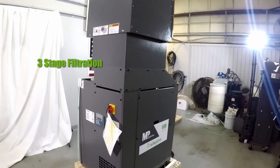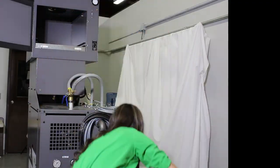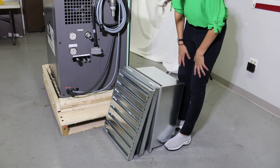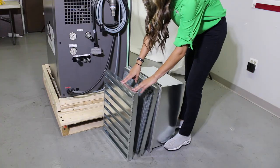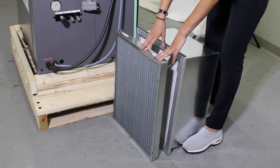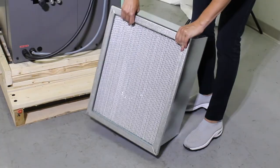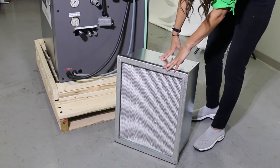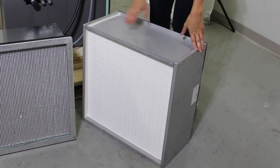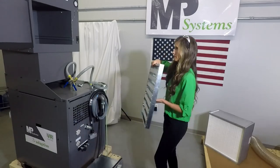This is a three-stage media filtration unit. I'm going to open this up so you can see inside and show you how easy it is to take out all three stages of the mist collector. This is the baffle filter — it is reusable; you can hand wash this one. This is the wire mesh filter, the second stage of filtration, and this one is also washable — you do not need to buy a replacement for this. This is the microcell filter; this is the biggest portion of the filtration and the only unit you would have to purchase to replace. There is also a HEPA filter option — the HEPA filter will replace the microcell disposable filter in the mist collector. Now I'm going to put the filters back in.